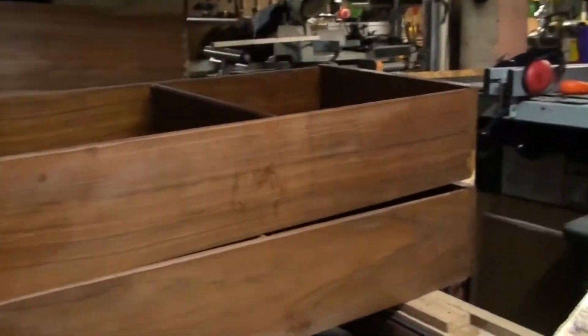So now that's just ready for me to put the set on, and once I know where I want it to go, I'll mark that and just use a 3/4 inch paddle bit to drill into the board here. Alright, so I've drilled my holes for my deadbolt, and I need to install my deadbolt now. And here's the actual bolt, which goes in, even tells you which direction it goes.